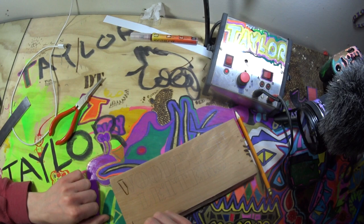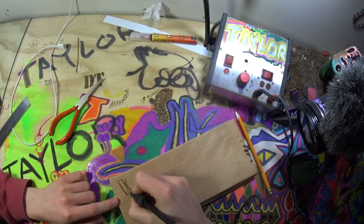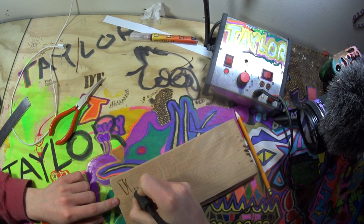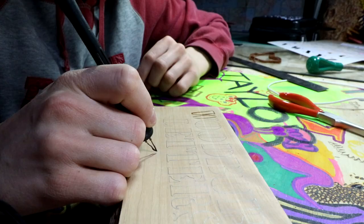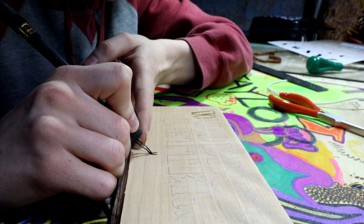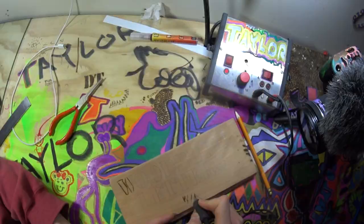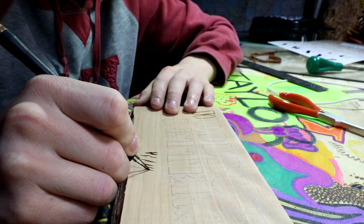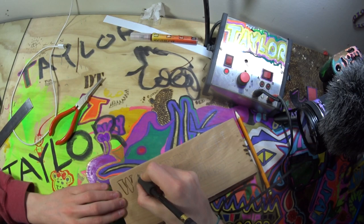I'm just using the edge of the skew. And then when I get up to the corners, that's where I'm using just the point so that I can go around those corners. A little bit lighter on the hand so that it actually goes around and doesn't dig in. That's something you'll get used to — how to actually make your lines. If it's a straight line, I use this chisel. It's hard to describe here on camera, but this is the way I kind of hold it — not completely flat. I want to lift this back portion up just a little bit because I don't want to control it with a point; I want to be dragging it, and then I have more control over it. The straighter the line, the flatter I will make the skew so that it's harder to divert from that path — it'll just kind of follow it nicer. So just practice making lines when you can, drawing straight lines, curved lines, seeing which works best for you to follow.